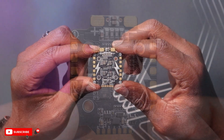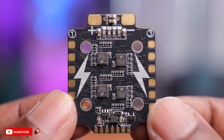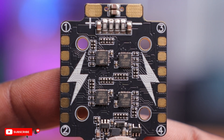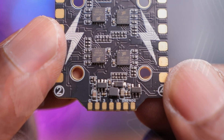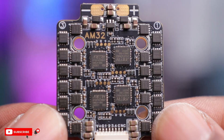There are two decent-sized power pads along with pinholes for the capacitor. Below that is the port to connect the flight controller to the ESC, which is standard. On the back, all the motor pads are labeled by motor number — one, two, three, and four. And if the plug were to get damaged or be too short, you can hardwire directly to the ESC pads.